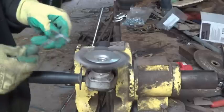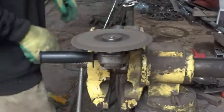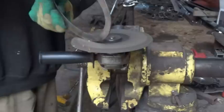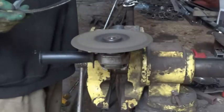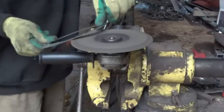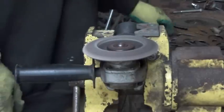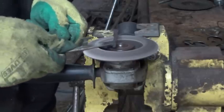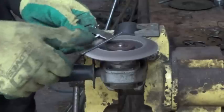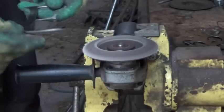But I got there in the end, and this is where the main difference in stainless steel seems to be. There is a lot of hard dross on the edges. On mild steel, there's usually nothing much, and it brushes off in seconds, leaving a nice clean edge. But with these, I had to go through each piece with a wire brush and then a grinder and finally a flap disc. The dross is hard and melted into the edge, so it was much more work to clean up than usual. But the advantages are obvious.